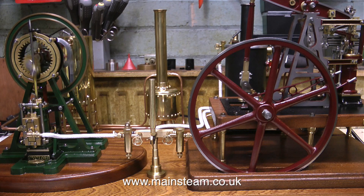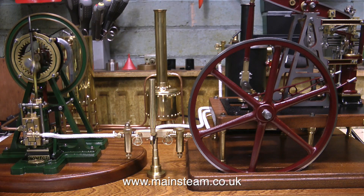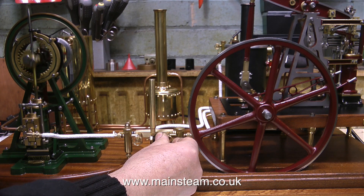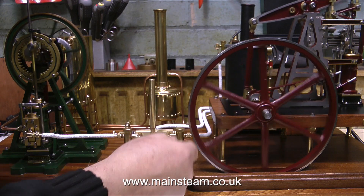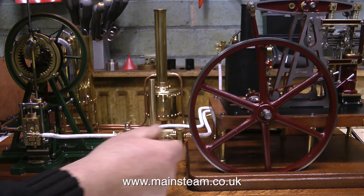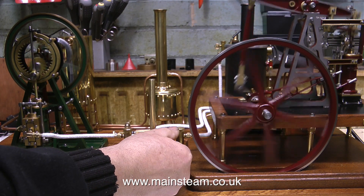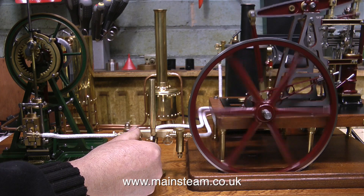I think that's about it really for this one — I'm going to let the process run by itself. The last thing I would like to say: you will notice in the video it's a bit of a balancing act getting both engines to run together. This is a very small boiler so there isn't much steam to spare, but after a bit of messing about and setting the valves they run quite happily — that is until I pump some cold water into the boiler. The steaming actually took about two and a half hours. Frequent adjustment of the regulator valves was necessary to get them to run together. I've really enjoyed building up the steam plant and I'll be sad to see it go on Thursday, but at least I will have some more space on my workbench. Thanks for watching and I hope you find it entertaining.